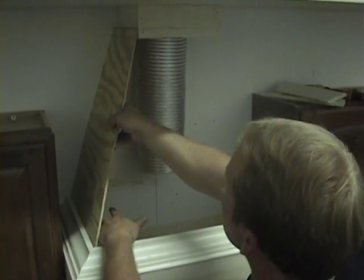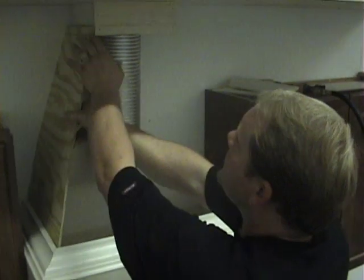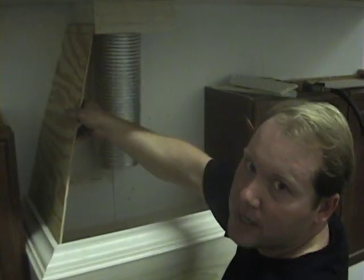on the lower frame. We're planning to put crown molding around the top of our upper frame to trim this out, so I'm going to go ahead and install that first so that I get a nice tight joint between my side panel and the bottom of my crown.